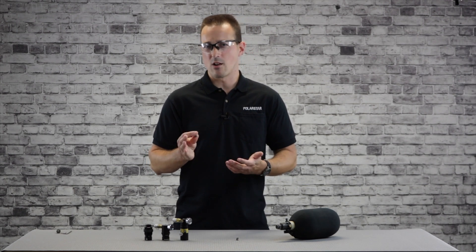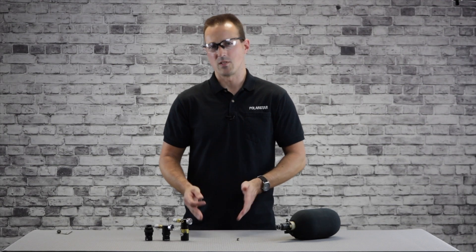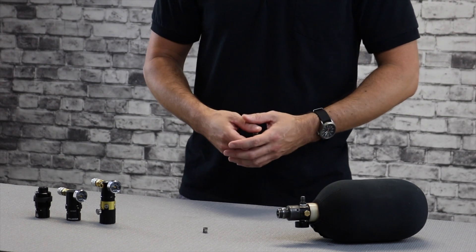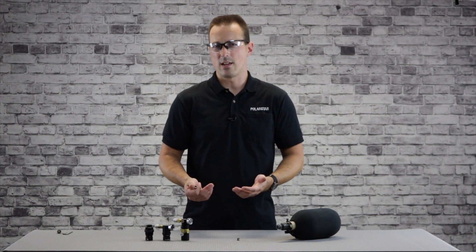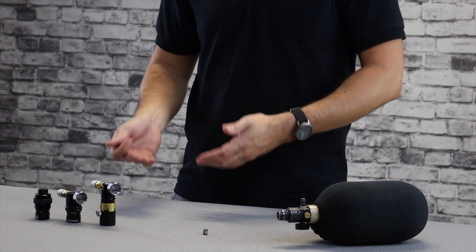So when people pose the question — if you still hit the lower pressure range with the high pressure spring, why don't we use it as the standard spring on our regulators — this is because the standard spring is tuned for optimal performance within the average pressure range used by most HPA systems. Although the high pressure spring allows the regulator to operate in that lower pressure range, it technically won't recharge as quickly as a standard spring, even though you'd have to be pushing the system pretty hard to see any noticeable difference.